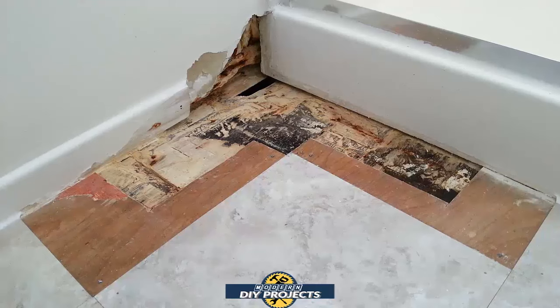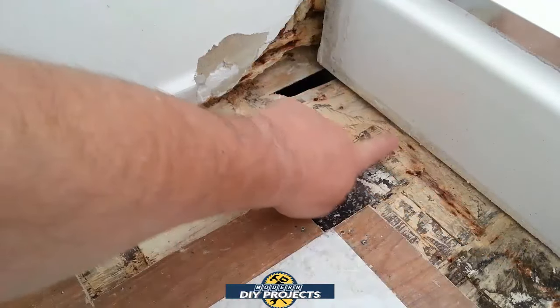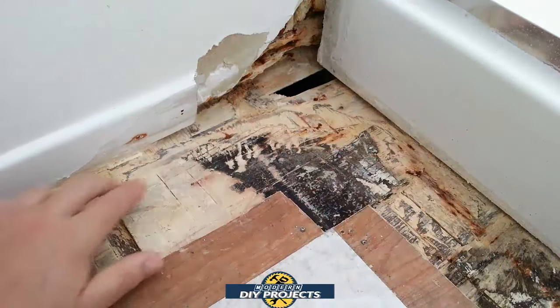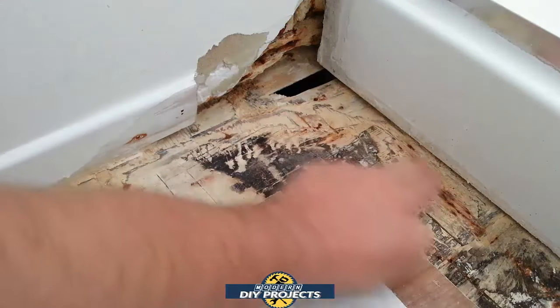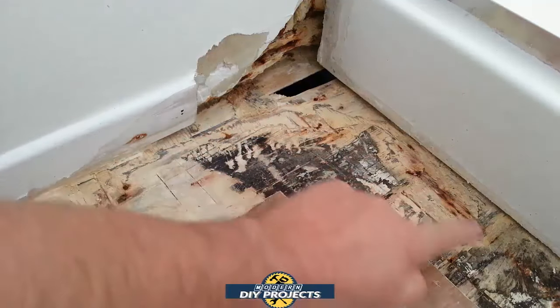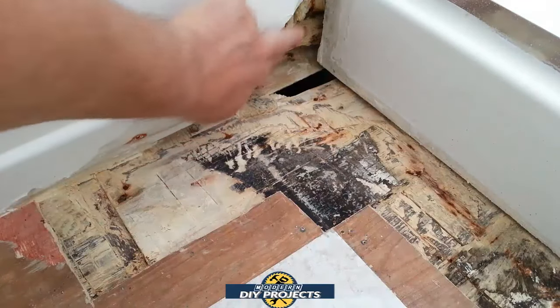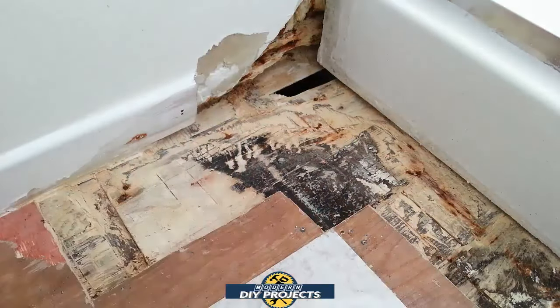Here we are looking at a different angle of the floor. The damage took place as the water ran along the shower pan and along the wall — it acted like a wick moving in those two directions. As you can see by looking at the floor, the soft wood that was made soft by the mold and the water, I chiseled it all out. All the damaged drywall has also been removed, and some of the two-by-fours in the wall behind it as well. That's not a load-bearing or structural wall — there's a bedroom behind that, so it's an interior wall.